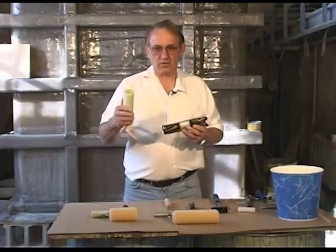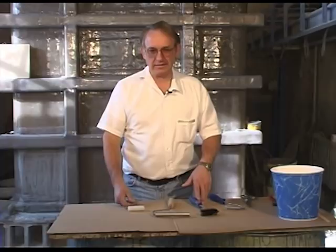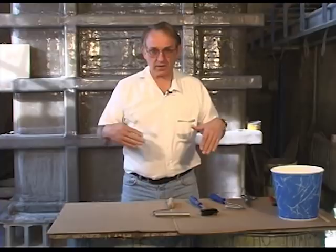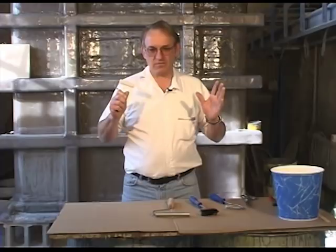After you've got your laminate saturated with resin, with a number of layers of mat, roving cloth, or Kevlar or carbon fiber that you've chosen, it's time to really work the air out. Air is an important thing that you need to get out. It degrades the laminate. It will actually draw water moisture into it because it creates an air bubble. And mechanically, it deprives you of the strength that you need. So for top quality laminates that are strong and very professional, you want to use one of these tools.